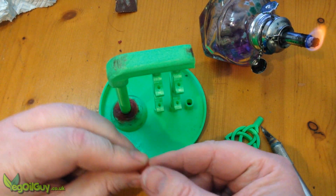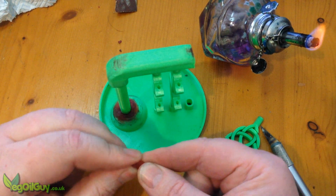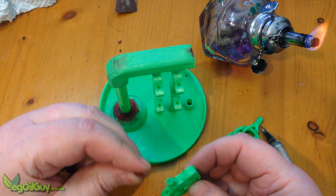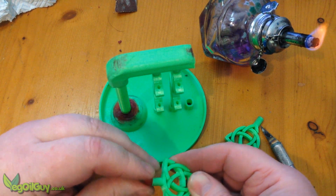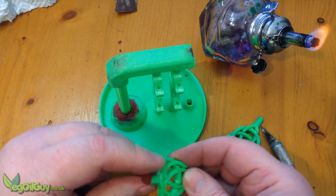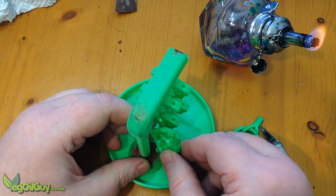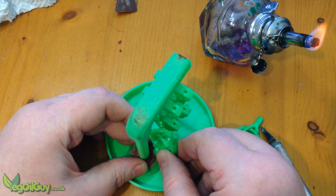I smoothed out any coarse printing pattern with a smear of positioning wax. That's the reddish brown stuff you can see. One of its true purposes is to attach wax patterns, so I couldn't resist positioning one as a test.